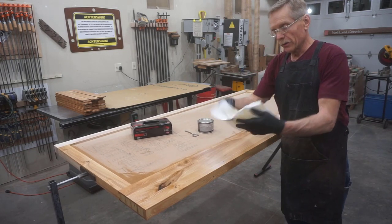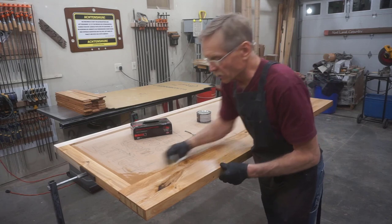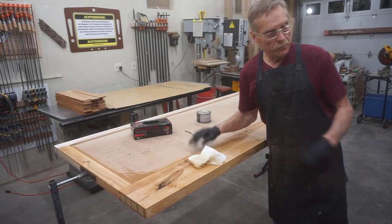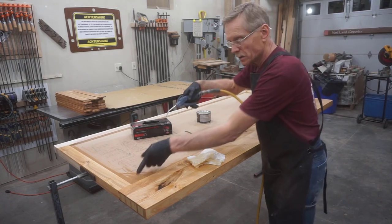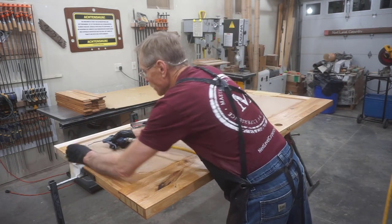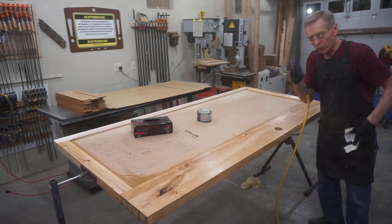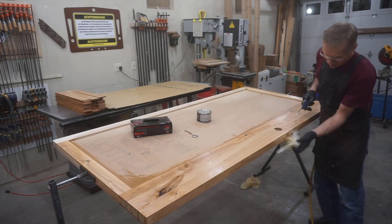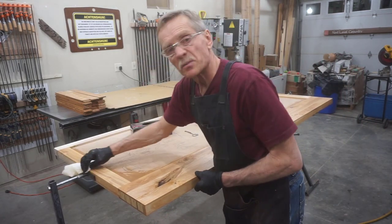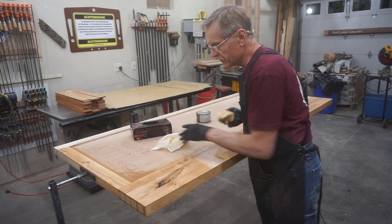It doesn't take long at all to clean up the excess and start getting that wonderful smooth sheen characteristic of gel poly on well-prepared wood. After all the globs I put on there, not very much is coming off in the paper towel — there's a surprising amount of that heavy thick varnish that gets down into the pores of the wood and seals it up and gives it a durable luster. Then I take compressed air and blow out any nooks and crannies, corners, character in the wood, screw holes for the hardware, etc. — I just blow it into a cloth or paper towel. That step prevents any excess buildup from getting little globs in those corners that won't dry well.